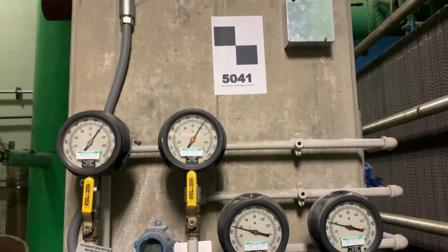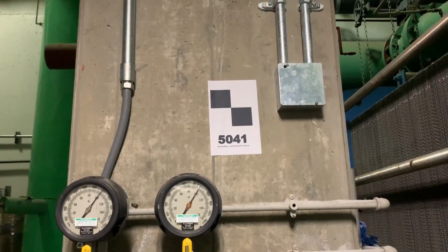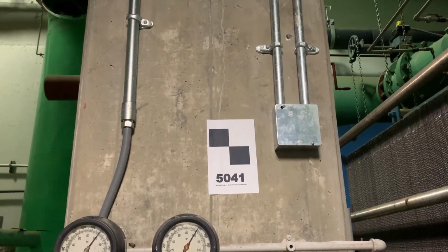When we're scanning inside and can't set control on the floor for a variety of reasons, we tend to use adhesive black and white targets. The person setting control will usually go in first, set the adhesive targets where they feel they are needed, then start traversing and tying all the targets in with the person scanning working in behind them. On the surface, this seems like a fantastic option. The targets are easily placed and removed, they aren't going to move on their own, and they are relatively cheap without permanently hurting the surface that they are applied to.